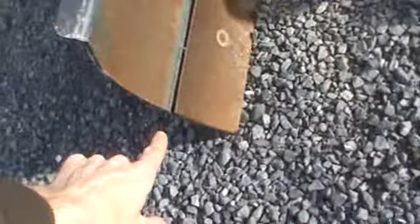This blade is offsettable — you can unbolt it and offset it. Again, 7-foot moldboard. You have a reversible cutting edge — you can see hardly any wear on the edge. The thing is not welded or busted. We greased it, cleaned it, and I won't lie to you — the guys rubbed a coat of wax on it. The thing is just that nice.